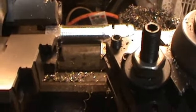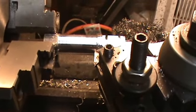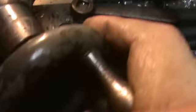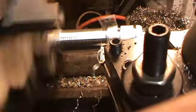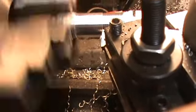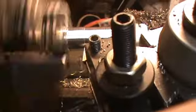Alright, we got it turned down. It was going a bit fast for an interrupted cut but we've got a straight shaft now. We're going to take off about 15 thousandths per side — that's 30 thousandths overall. That cut is pretty easy; I can probably speed this up. I'll continue until I get it close and then show how to get it over the shoulder.